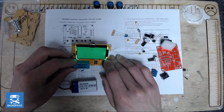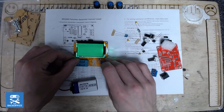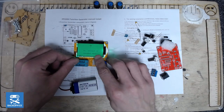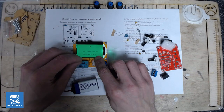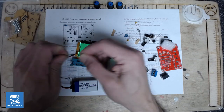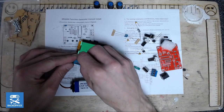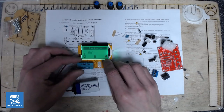What the frig is going on with this? Is it possible I've actually got a faulty resistor? That is bonkers. So remember, we put this in the multimeter, it's giving us a meg range on that. It does look like we've got a faulty resistor. And if you remember on the last calculator kit, we had a whole PNP transistor supplied where it should have been an NPN, which screws you up. Aha. So it's saying this one's a 1K.